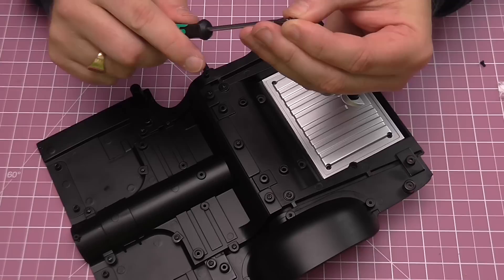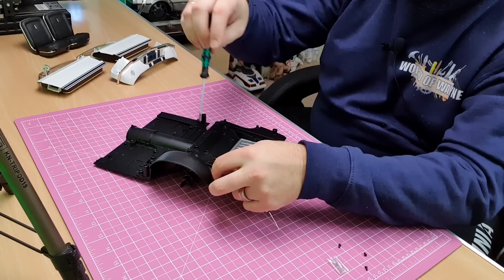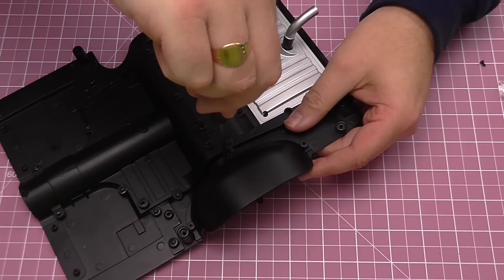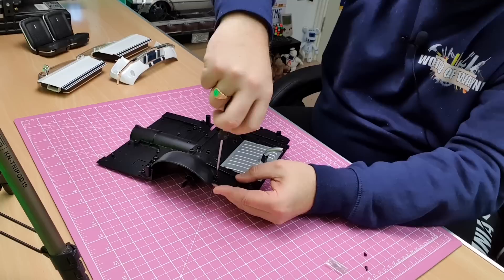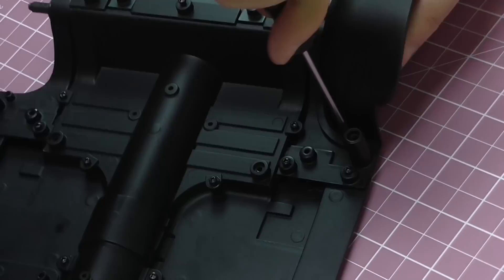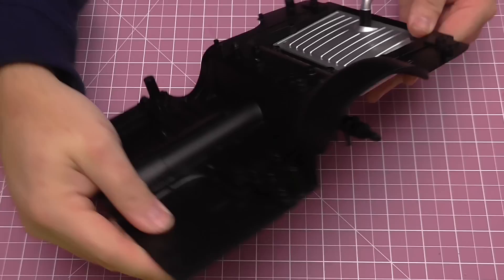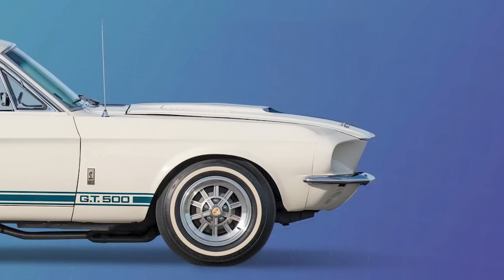This is a nice quick stage, but can you believe how quickly this is building up? I'm going to drop some oil into the holes. I'll put the center screw in first — that's probably better — and then we work on the other two screws. Just remembering to use the technique of putting the screw in, letting it bite, then taking it out, blowing away any shavings, and then putting it in and driving it home. When it's in nice and tight that's looking just like that.